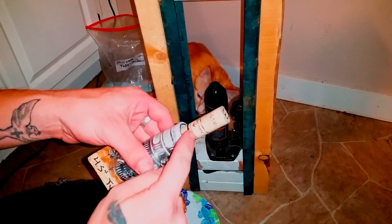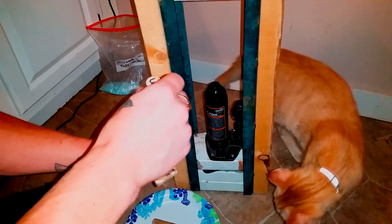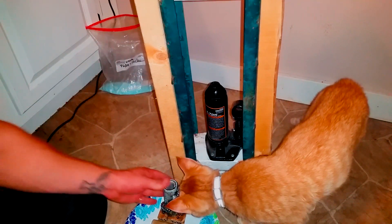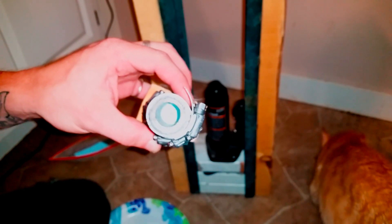It might be a little difficult to get this out — it really depends on how tight the dowel fits. It should be a good tight fit, but it depends on your tubing, your clamp, and everything. See if you can see in there — that's already most of the core. You can see most of the core is covered, but we need to press one more time with this long rammer until the coring piece is completely covered. Then we're going to switch to our next rammer.